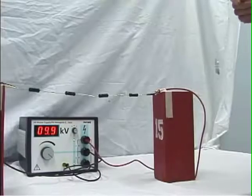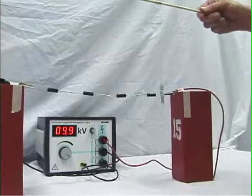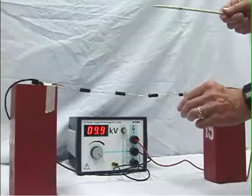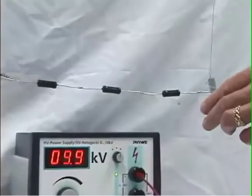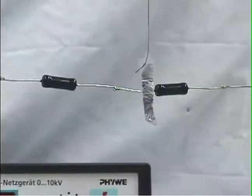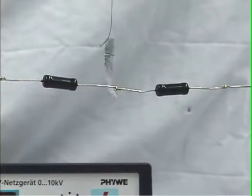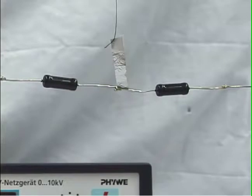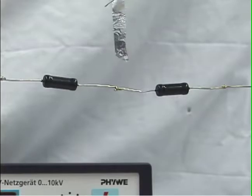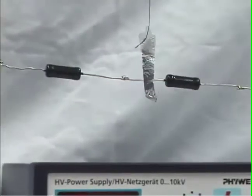If we take the foil to the center of the resistor chain, there we expect the distribution of surface charge to be essentially zero, because the circuit charge is going from positive to less positive to zero to negative to more negative. So here in the center of the circuit, indeed we see nothing happening to the metal foil. In an ordinary low voltage circuit, the amount of charge buildup to make the small fields is insufficient to see much, but here we can see mechanical effects.